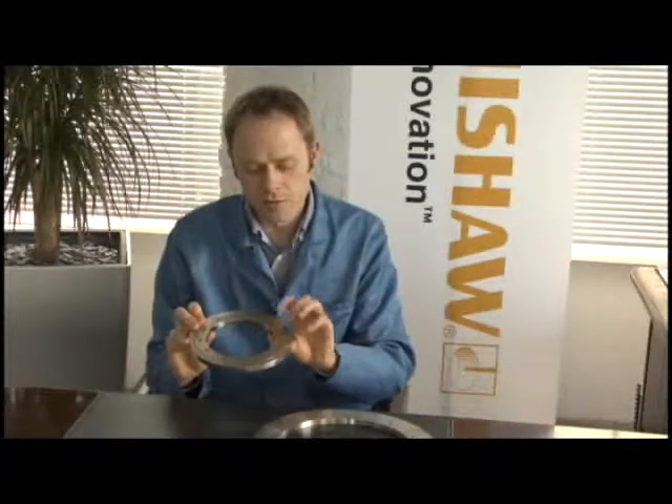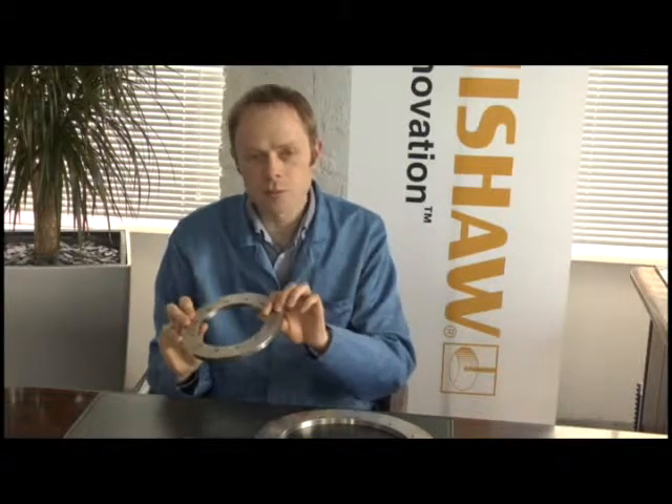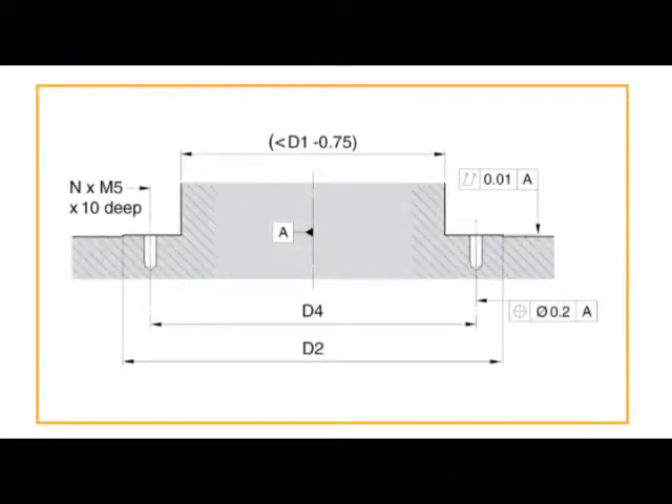There's a step on the rear face of the encoder. This is to ensure that the surface area that has to be made flat on the mounting face isn't too large. The recommended mounting surface is 10 micron flatness for ultimate accuracy. We use a tighter spec during the graduation process using highly ground surfaces. The ring itself does not need to be this flat.